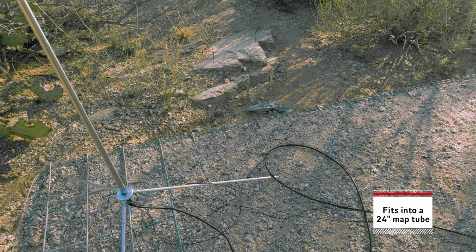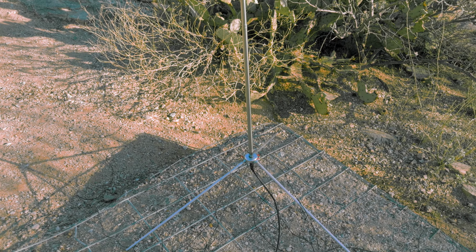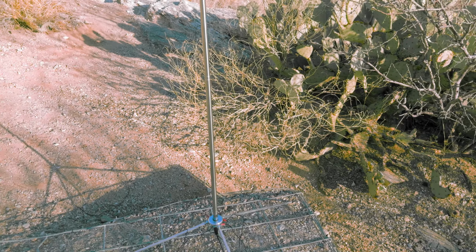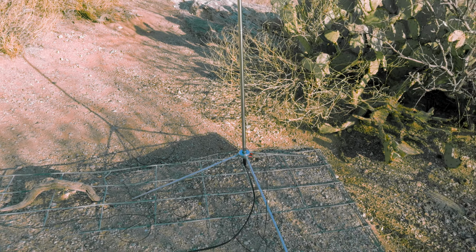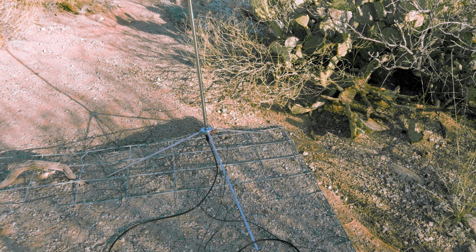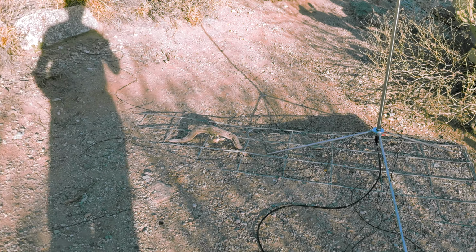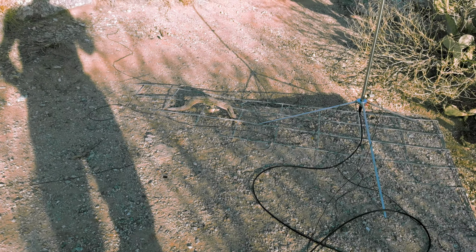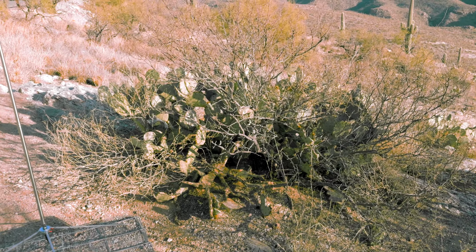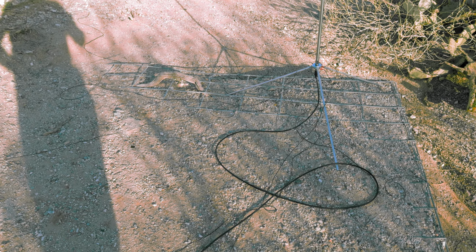It's really easy to set up. This kit came with the three radials and I already had three. The antenna book says that you should have radials 120 degrees apart, but when you're just quickly setting up, it's hard to get a perfect 120 degrees. It's also hard to get the whole 33 feet out, and theoretically they should be longer than 33 feet. So now I have two sets and they can all be 60 degrees apart and I can just quickly throw them in one direction. Also, these cables versus regular speaker wire, which is the cheapest solution.